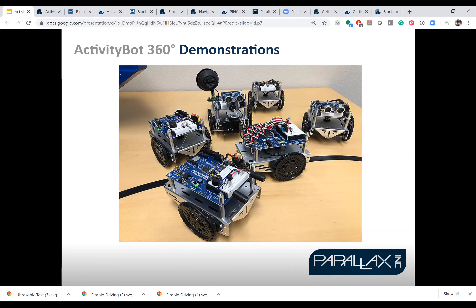We do have a quick question about the gripper — are there any current model grippers I can buy for the Activity Bot? The ones I prefer are those from Servo City — they make simple claws that are usually one degree of freedom, and then some attachments that lift them for the second. There's also some on Thingiverse. So you've got 3D printers and servos. I made a really simple set of grippers — they don't move up or down, they just grip, close and unclose — and they're on Thingiverse. If you have that link, paste it in the chat or we'll distribute it.